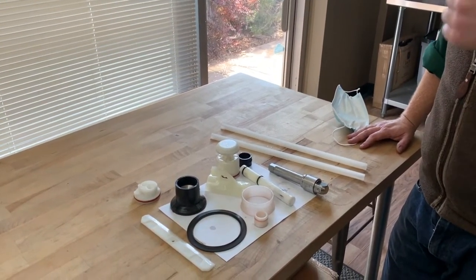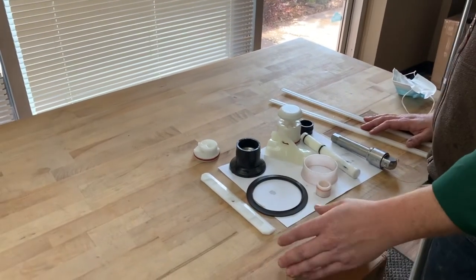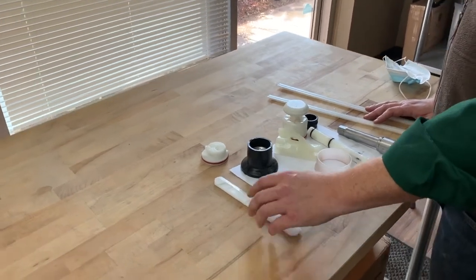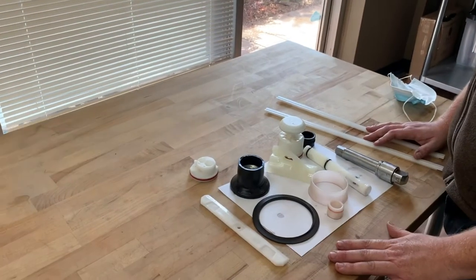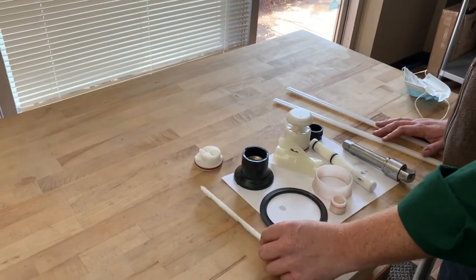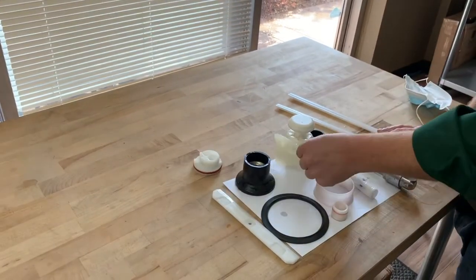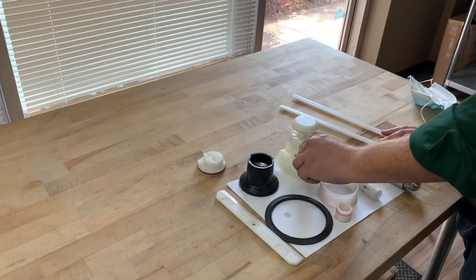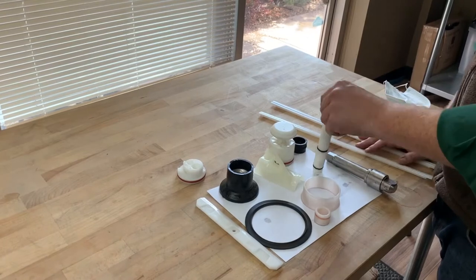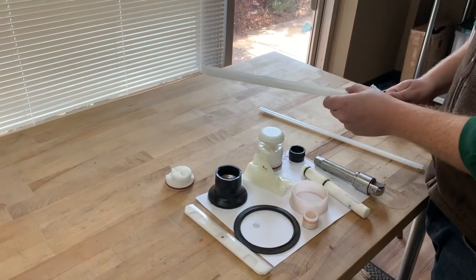And to finish up here, we want to talk to you a little bit about wearable parts. Wearable parts, meaning parts on a machine that are meant to be worn and that you may need replaced at some time. There are very different models and things shown here. We have a frozen drink machine door gasket. We have a blade for a Taylor frozen drink machine. We have an air orifice for a pump, and then O-rings. We have a blade for a Stoelting machine. And we have a collar or a bearing for the Taylor 430. We have a plunger, and then the O-rings and the plunger, and then a rear seal, and then Taylor blades.